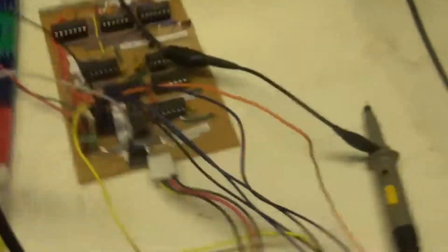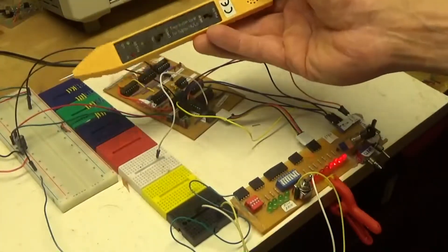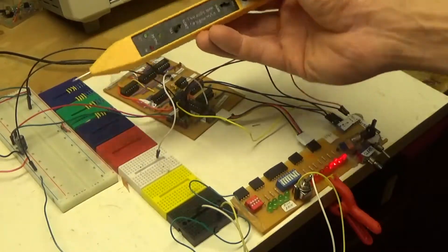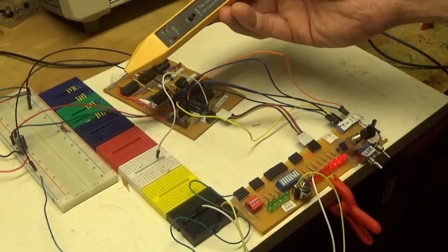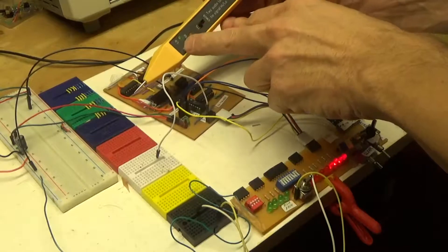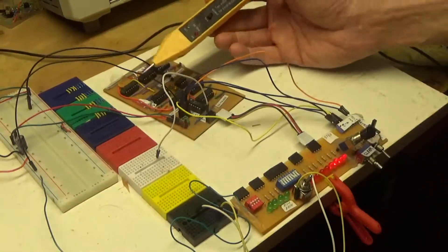I thought I'd share that with you. I purchased this little logic tester unit from Jameco. It's a pretty neat little device - it's lightweight, there's no batteries in it. You plug in the positive and negative to your circuit, and you don't want to exceed 20 volts. You'll have a high/low light that comes on and a pulse indicator. It's really neat to test this stuff out really quickly.